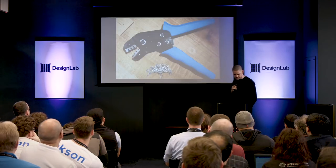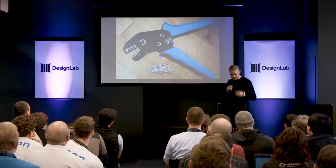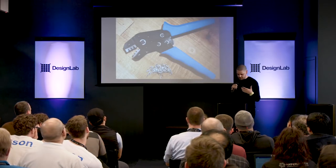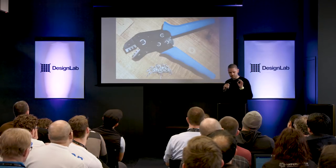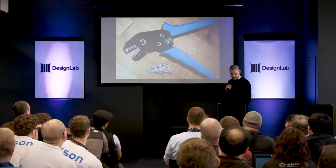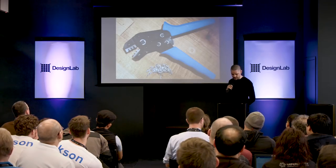Connectors — bad news first. There are a dozen large-scale manufacturers specializing in connectors, each with hundreds of series in their catalogs, and their websites universally suck. Parametric search for connectors from major suppliers is not much better. The products themselves are very good and reasonably affordable, and the easy majority of ones you'd want to use are compatible with inexpensive universal crimping tools. If you're starting out making cables, you can go a long way with square pin box headers in 2.54mm and 3.96mm. The parts are everywhere, never out of stock, and the tools are cheap and forgiving. That's a really good set of training wheels.